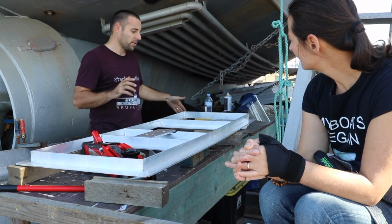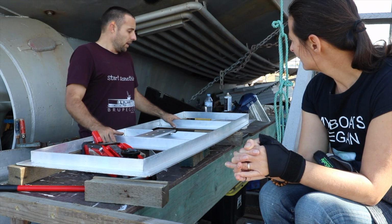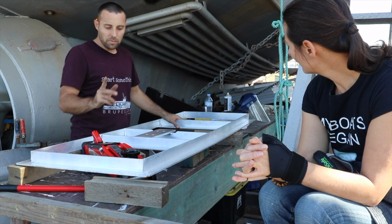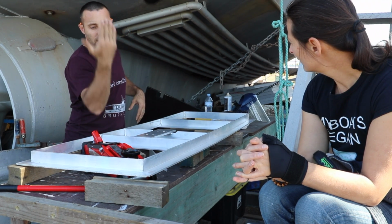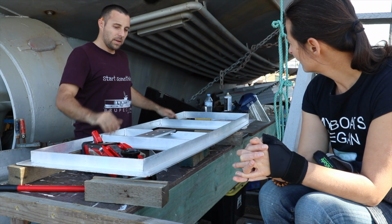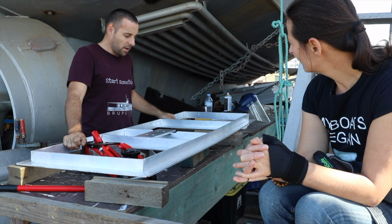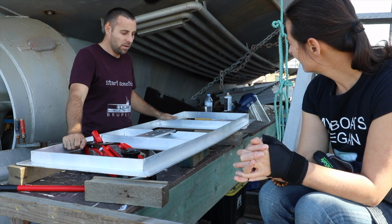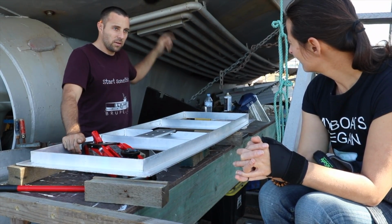So whatever we've done has given it half an inch of the direction we want. However, it's not enough, and I'm struggling to get any more bend out of this corner. So what I'm thinking is clamping these three down and jacking that corner up, so the two opposite corners would come up versus these ones staying put. I'm hoping that's going to put that last half inch of twist in the door. So we'll do it. We know it's half an inch away because I measured it.